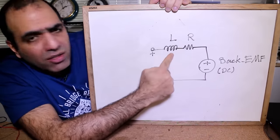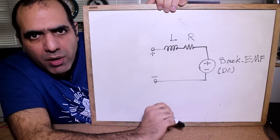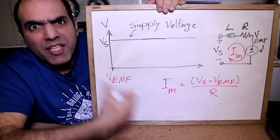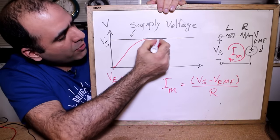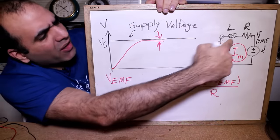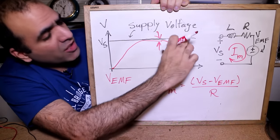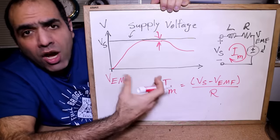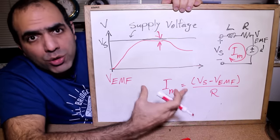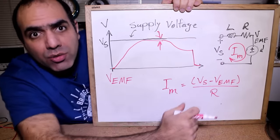You can model the DC motor at the supply lines like this: the inductance of the winding in series with the total resistance of the motor, in series with a rough DC voltage supply. For a well-made and lubricated motor we expect a small input current when no load is attached. When we start the motor and it speeds up, the back EMF voltage rises close to the supply voltage, creating a small voltage drop across the motor resistance, which means small current draw. As you load the motor it slows down, the back EMF drops, causing higher voltage across resistance and higher current draw. The higher current results in a stronger magnetic field, so the motor turns with stronger torque. This is why if the motor ceases to rotate it can burn — because the back EMF drops to zero and the entire supply voltage falls across the resistor.